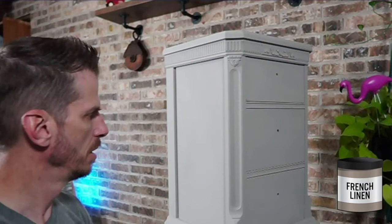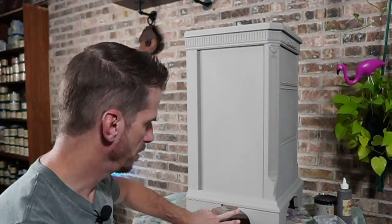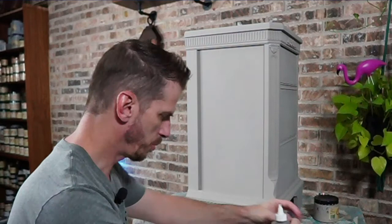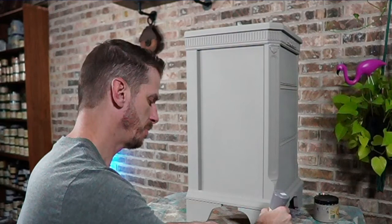I think we're ready to go. I did not put two coats. There are some spots where it's a little thin, but I feel like you have a little bit of grace because the piece is old — it doesn't need to be perfect. You can do two coats if you want. I can even see some of the gray Boss I used; I love gray Boss. Sometimes the gray Boss becomes part of the coat, but we're going to use the voodoo gel stain to compensate. Between the voodoo gel stain and the gold gilding wax, the focus is not going to be on the finish of the paint — it's featured, but it's not the main role.